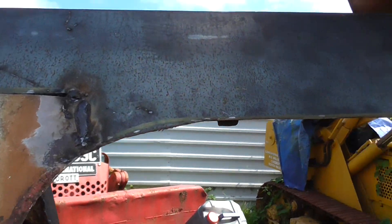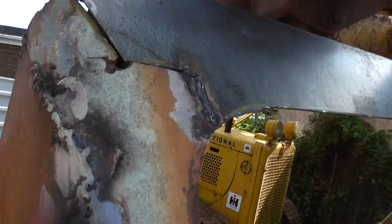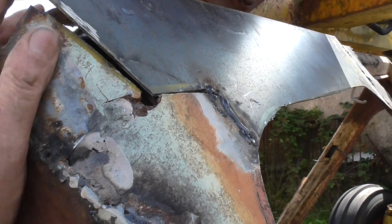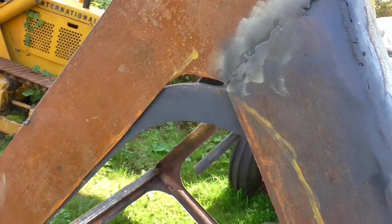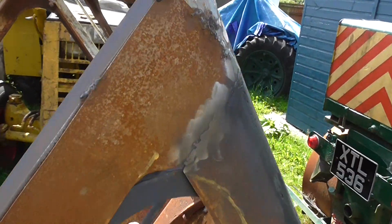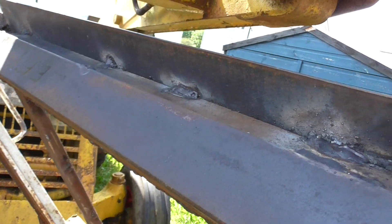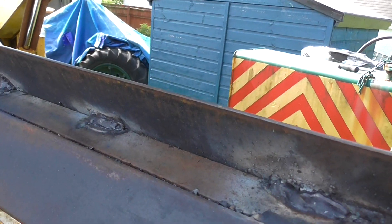The plan is to warm that up — never got my oxygen — to warm that up there, bend it over into a nice curve. It's welded down there. The back is now looking a lot better. It's quite a strong structure, getting heavier by the day with the amount of metal. As you can see, on the top I've welded in a 30mm angle iron.